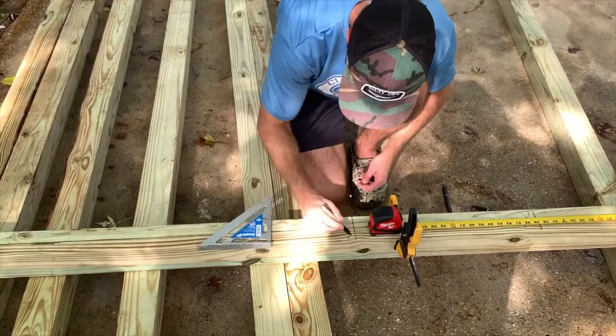So just like before, I'm sliding the slat wall panels down into the J trim on one side and then the H trim on the other side. Again, that H trim is gonna be filled in on the opposite side with smaller segments later on. Tuck it into place and make sure that you have the bottom of the panel tucked into the starter trim at the bottom as shown.